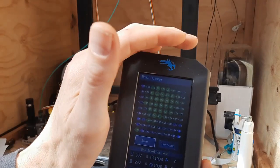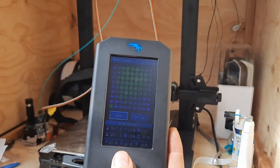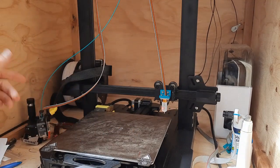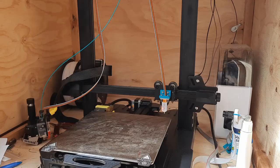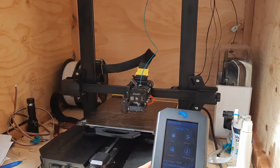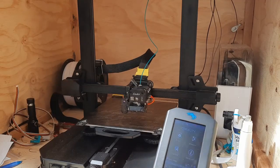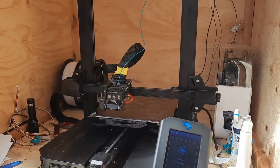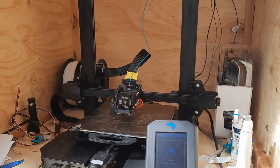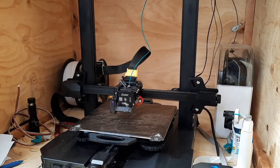There's my mesh - hard to see but there's a higher part in the middle just over here. Now that's done, put the original extruder and probe back on and print away. I'll leave my probe offset at zero zero - you could change it back to the factory value and still keep the original mesh, but I'm not going to worry about it. It just means when it does a home it'll be slightly off to the side rather than the center, but that doesn't matter.